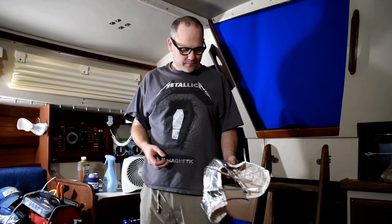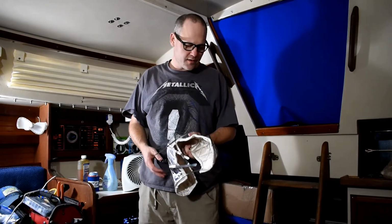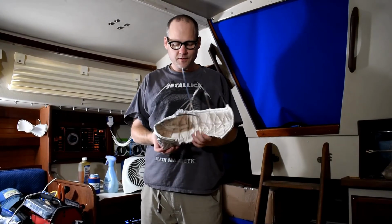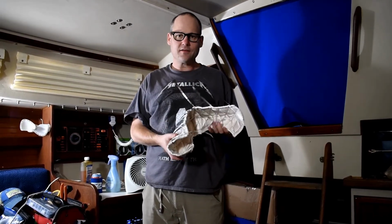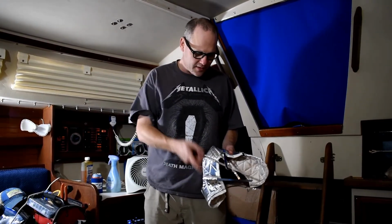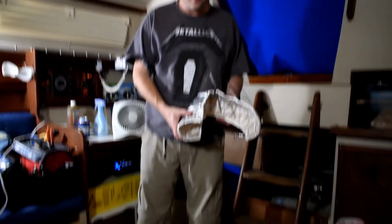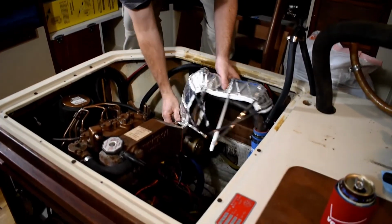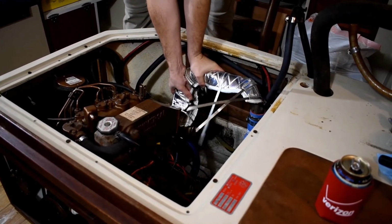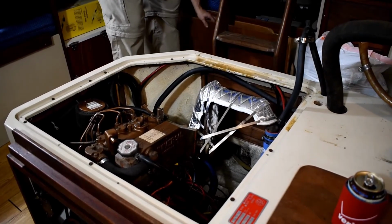So the last thing we got to do is put our exhaust riser jacket on. The other one, the old one, looked like an ace bandage, and this one looks more like Gilligan's Island when they had the radioactive meteorite and they had to put on those lead costumes, and it goes on the exhaust riser there. Can you see that if you zoom down? Yeah. Okay, so it goes on here like this, and it has stainless steel bands to put it around there, and the function of that is to keep the panels from burning.